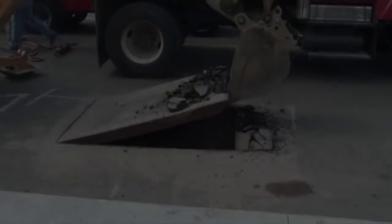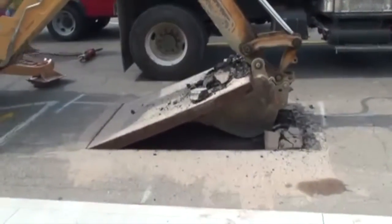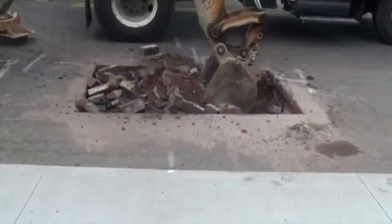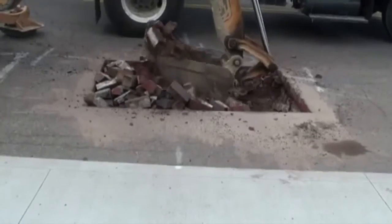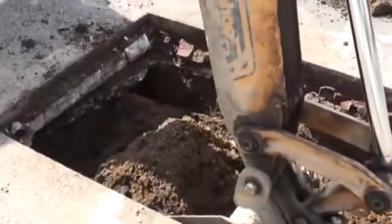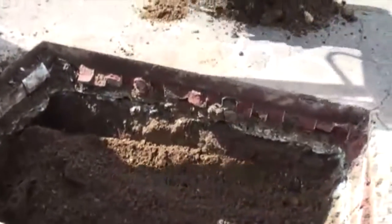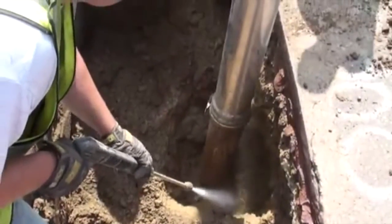This video shows all of the steps of using a Hydrovac excavator. It starts by removing the pavement slab that is over top using a jackhammer and a shovel excavator. This type of excavator, however, is limited in its ability to dig around underground pipes, because if it strikes them, it will cause damage. Once the shovel excavator has cleared the topsoil, the Hydrovac excavation starts.